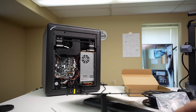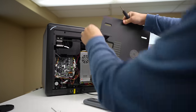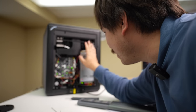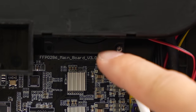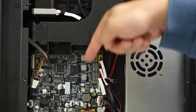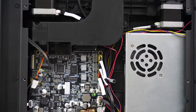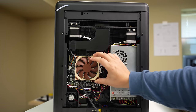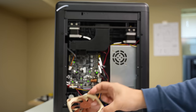Here's the control board — it's pretty big, a beefy board. The fan making all the noise is right up here, blowing air down across these heat sinks, which I assume are the stepper drivers. I'm not a huge fan of that. If we had a Noctua fan right here, that would provide adequate cooling and produce almost no noise. Noctua reached out to the channel a little while ago and sent over some fans, as well as a 24-volt to 12-volt adapter — most 3D printers run on 24 volts, but Noctua fans typically run on 12 volts.